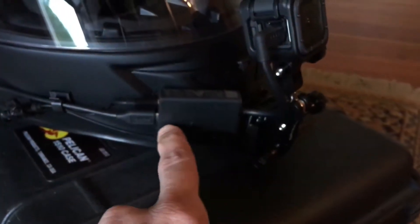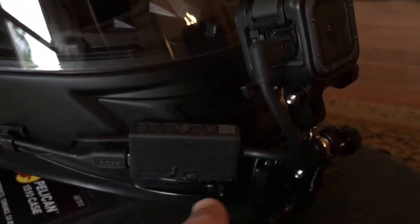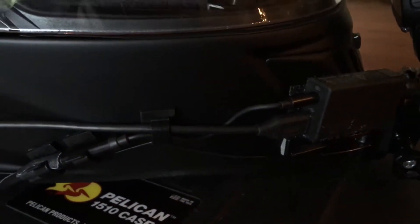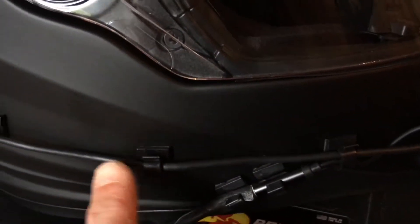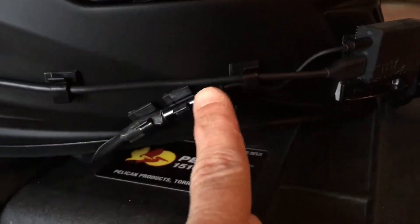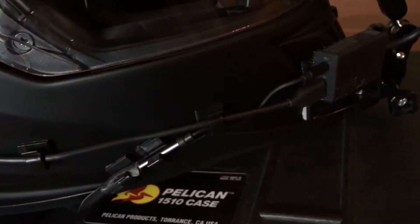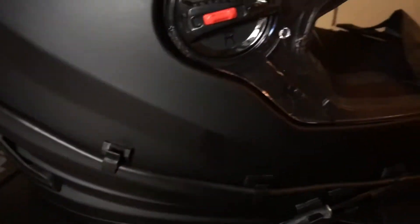I didn't really want anything big and gaudy. I've got a GoPro adapter here that's velcroed right to the front, and then the cable routes up into the camera. On the side I have my audio mic input and then my USB to give it power — this is USB-C. I put these little clips to route the wire through so it wouldn't look ugly and would have some uniformity. It goes down into the helmet, and there's a little connector that converts from TRRS to TRS so that it'll work with the GoPro audio adapter.